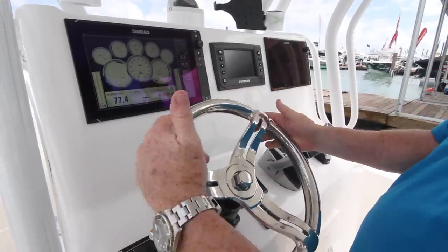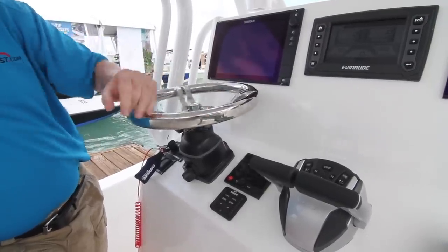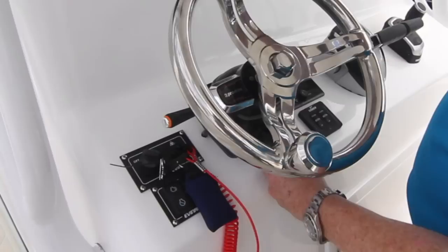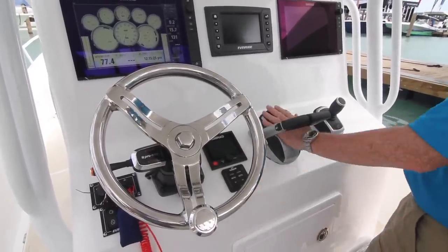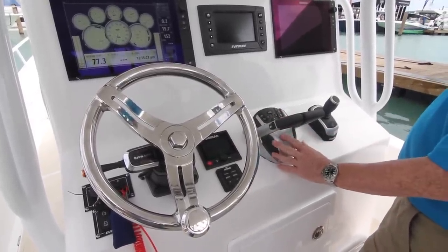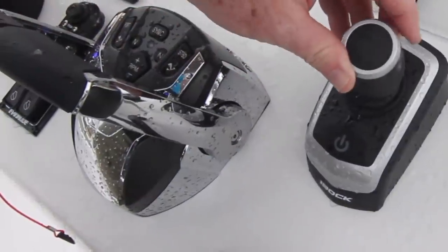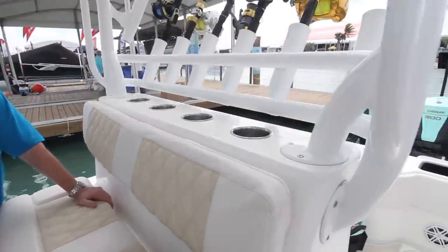The steering wheel is stainless with a steering knob and mounted to a tilt base. We counted three and a half turns from lock to lock, but remember, with the Icon screen we can control the number of turns and the feedback. The jack plate control is just to the left. To the right is a Simrad Autopilot and the trim tab rockers. The Evinrude engine controls allow for a host of features, including RPM tune speed assist, single lever control via the sync button, and engine sync matching the speeds of all engines. I also appreciate the neutral detent and indicator lights as additional feedback. Alongside that is the iDock joystick making docking a breeze, and I like the positioning allowing for facing aft while maneuvering the stick.